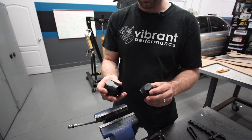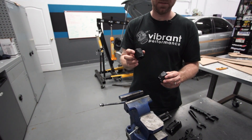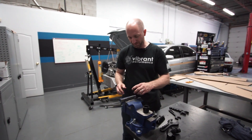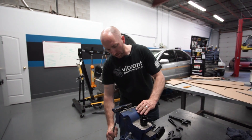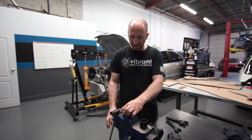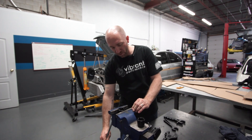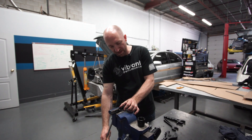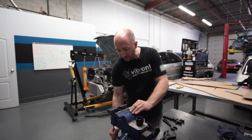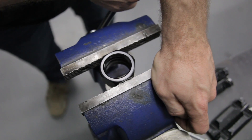I've got another nut here — this is brand new, never been used. I'm going to show you what happens to that hose nut when you put it in a vise and tighten it down to assemble this. If you look closely, it's just snug right now, but if I apply some force you're going to see that nut squish a little bit, and there's no way you'll be able to assemble it. You see that deformation there?